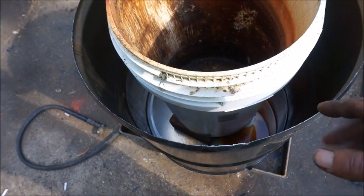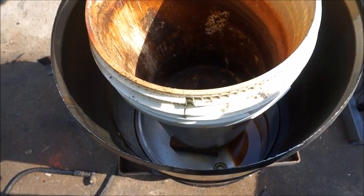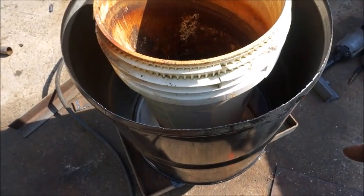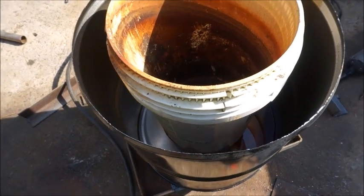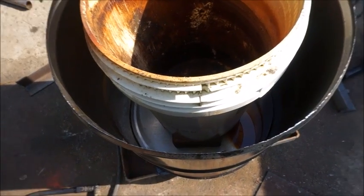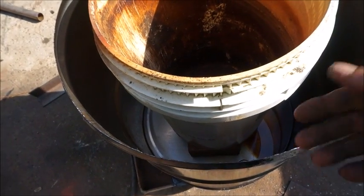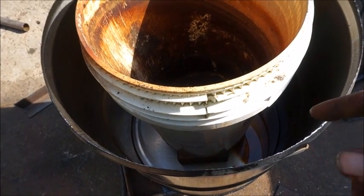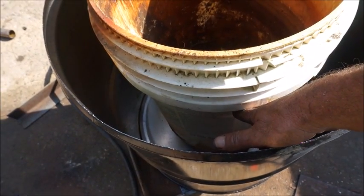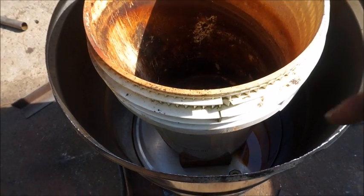I've just blocked this up. I'm going to pour up to where the bottom of this bucket is, which is four inches high up to that pipe. This bucket is what I'm going to use for the center hole form — I don't know if anybody else does this but I've done it on my last one and it works out good. I actually do this in three stages: do the bottom up level, then pour up the bucket, then pull the bucket up and do the rest.